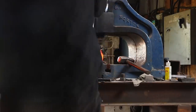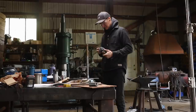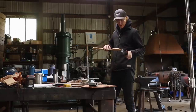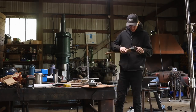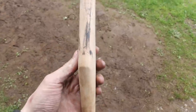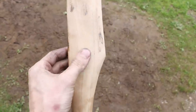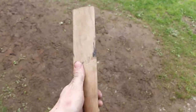So I've taken it down. I think I've got it, but I'm going easy — I don't want to go too much. We're really close. I've got some compression on the front and back, but we need a little bit more on the sides. So we're going to take the drift down a little bit more, and then we'll make another axe and try it out.